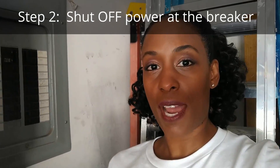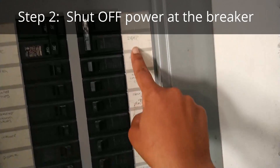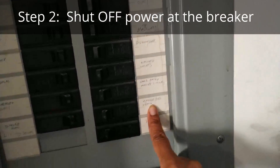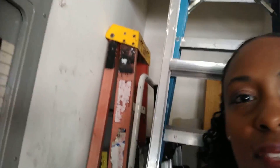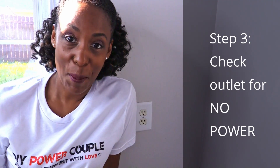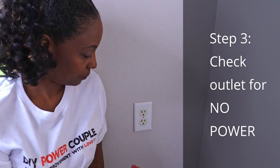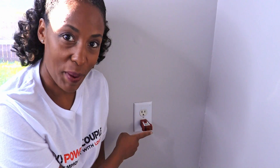Okay, now I'm in the garage and we're going to cut off the power. That's important. So I'm going to cut off the fuse box. Fire, master bed and bath, amps, and we'll turn it off. Okay, that's an important part to turn off the power and now we'll check that the power is off at the outlet. We're going to check that we do not have power before we start tampering with the outlet. So we'll use this again. No power, so that's good.